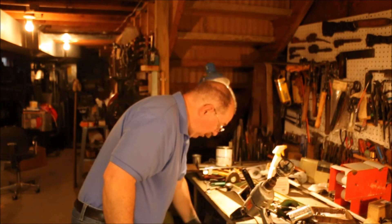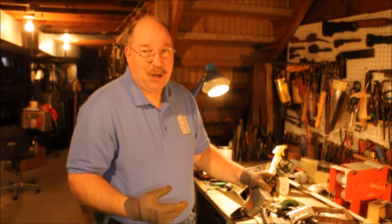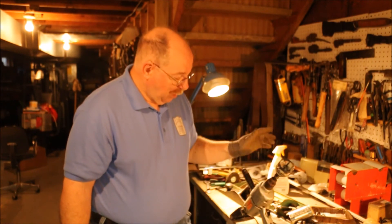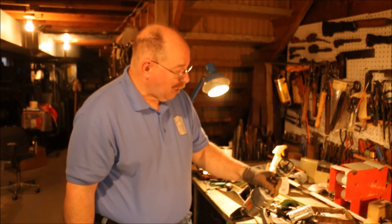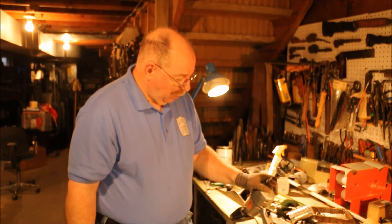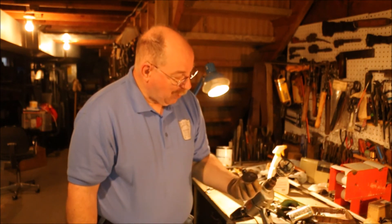Now I have a power drill press out in the garage — the Jet — and I can put that on low speed and hole saw holes all day long. I think I could do that a lot easier than standing down here making noise in the basement, but there's snow on the ground today and it's cold out in the garage. So I wanted to do a quick test just to see how it would work, and I think we're successful. This half inch drill motor has more than enough horsepower to run that size hole saw. I've cut four inch holes with it. With a sharp saw it really drags it down, but with this old Black & Decker I definitely can make a two and a half inch hole in a piece of plate steel.